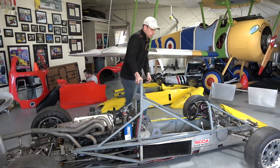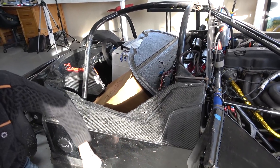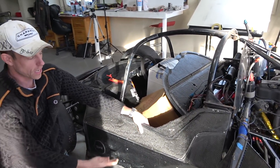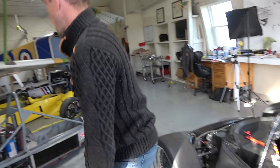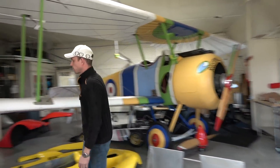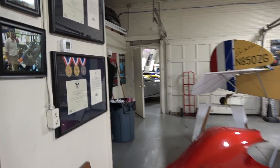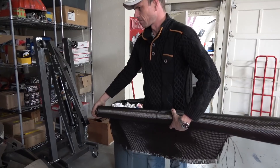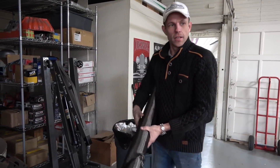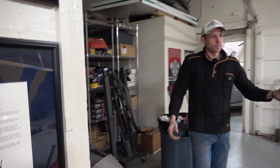The difference between carbon fiber and fiberglass is really just the fibers and how you lay it up. You could vacuum bag fiberglass and make a beautiful weave just like this carbon monocoque - you could make a fiberglass monocoque. Conversely, you can take carbon fiber and lay it up wet just like typical fiberglass. The strength in both comes from the fibers, not the resin - the resin just orients and holds the fabric in place. Vacuum bagging sucks out excess resin so it's all compressed with low voids. It really comes down to cost, structure, needs, and strength.